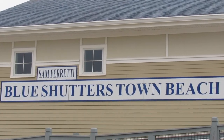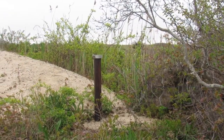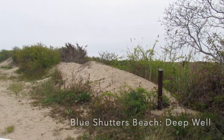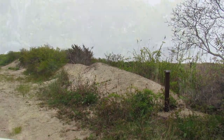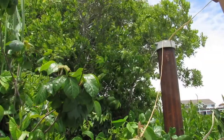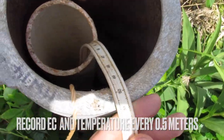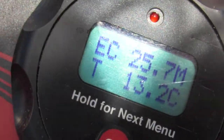As mentioned, our surveys measure bulk resistivity. If we have a well in a survey location, we can get what is called ground control, which validates our ERT data with point data of the water level and electrical conductivity from a well. Using an EC meter, we monitor a well every half meter, collecting electrical conductivity and temperature. This is typically done every two weeks and gives us a baseline of the water table to compare to.